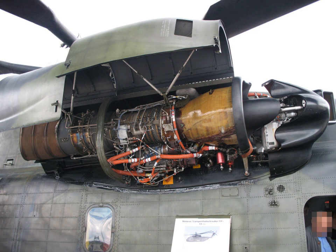Fourteen compressor stages are required to deliver the required overall pressure ratio. Compressor handling is facilitated by four rows of variable stators. Unlike the T-58, the power turbine has two stages.